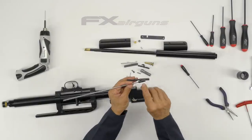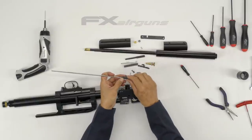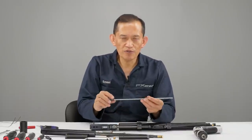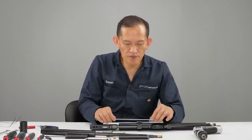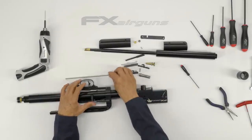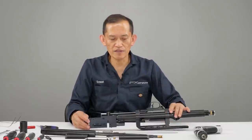When you flip it over there's a little pin that catches the hammer — that's how it cocks it. To reassemble a little quicker, before you take this apart I usually mark it here and on the action with a little marker to put the rod back in position. If you forget, we'll set it later and set the position of the probe — there's a certain measurement for that, which we'll go into detail during reassembly. For now we just take it apart.